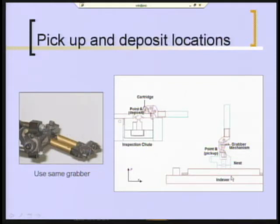This is a cross-section of the machine, which they created in Pro-E. It shows the indexer. You're looking down the barrel of the gun here. This indexer is moving out of the page towards you intermittently. Move, stop, move, stop. That's what's meant by an indexer. And the indexer has a number of nests on it, and each nest carries a product, which is right there.